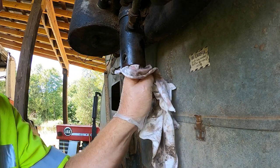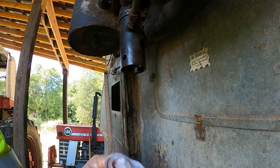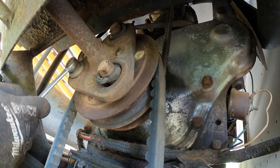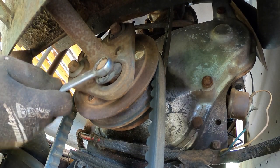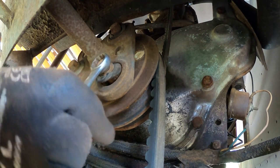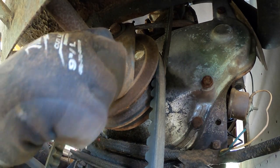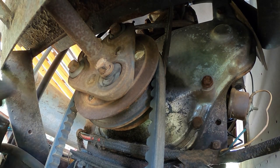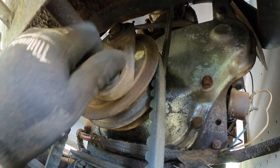So I'm gonna put the new filter O-ring in, get this buttoned up, and we'll move on to the snubbers on the crank pulley. I will try to get you a couple of shots here, something the size of my hands, but I broke all the bolts loose. They're not this loose to begin with, but I say we just pull this bolt out, and that sleeve should still be in there. The rubber's just gone. Oh, look, you get nothing but my hand. Camera angles are tough at times, guys.